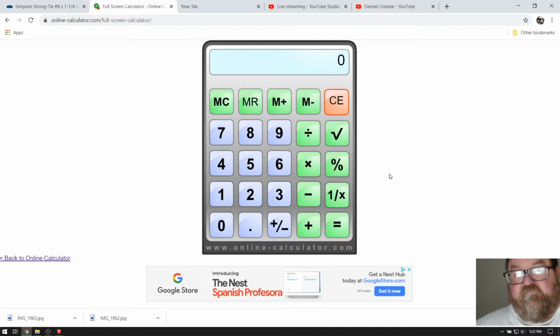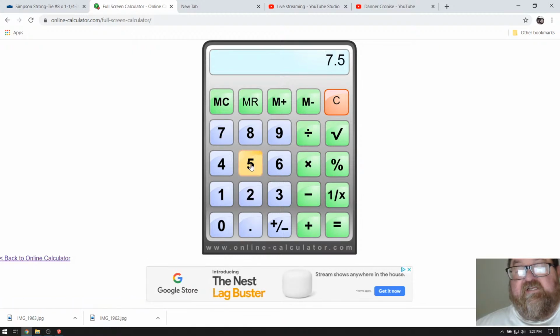So you might be thinking, how do I do this? What you do is, the typical riser you want to shoot for is 7.5 inches. Okay, so this is just a quick little exercise I do for every stair. It's real simple. You take your height, 96.5, and divide it by 7.5 just to see if you get lucky and it'll go an even number of times, right? Well, it won't, okay? It'll go 12.8666, and we don't want to use any kind of 666 in our drawing, okay? That would be satanic. But anyway, just a little religious humor there.